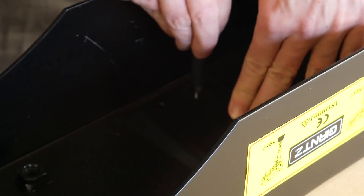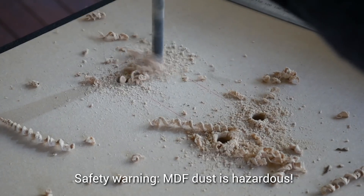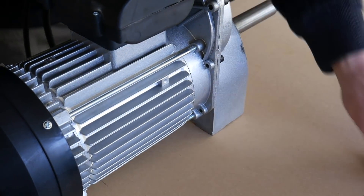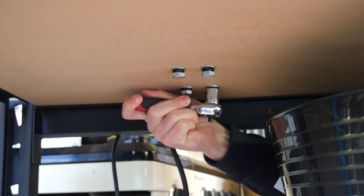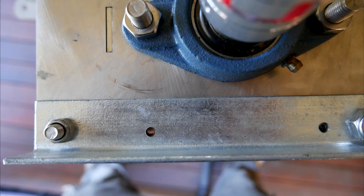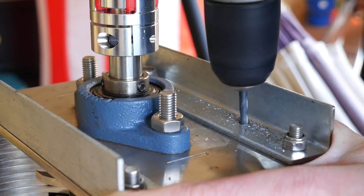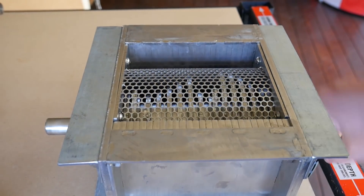After tracing the motor base I used the discarded black bracket as a template to drill four mounting holes. Safety warning: MDF dust is hazardous and you should avoid breathing it in. With the mounting holes in place I reused the bolts that held the black frame to fasten the motor to the table. The sieve to the shredder box wasn't attached, so I drilled the holes to align perfectly and used M4 bolts to hold it in place so it couldn't shift during operation and jam the machine.